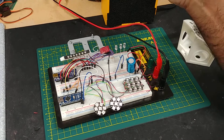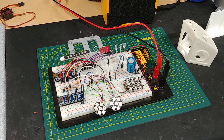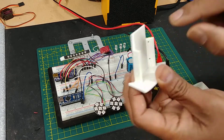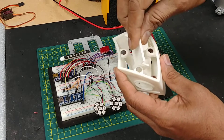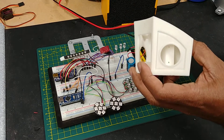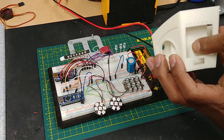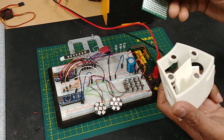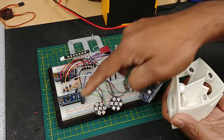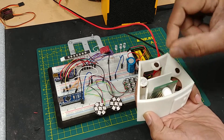I'm going to have two Arduino Nanos running all of this. I made this little insert with two holes on each side that fits right in and gets glued in. The NeoPixel jewels will attach to those holes inside, set back a fair distance. The array gets glued onto the front of that. I've got a little breadboard with two Nanos on here, and it'll just tuck right in so I can pull it out and reprogram it if needed.